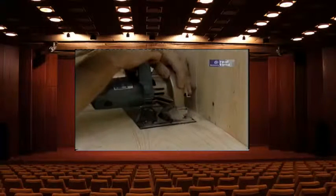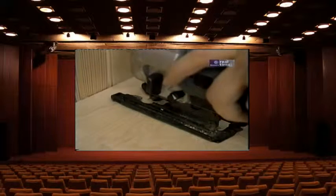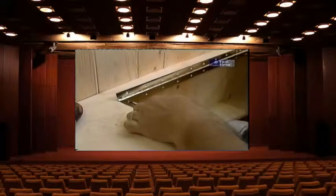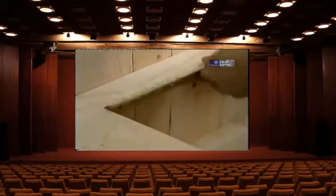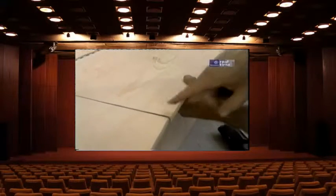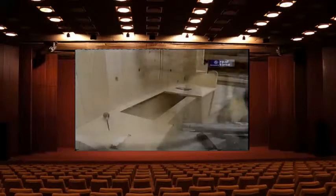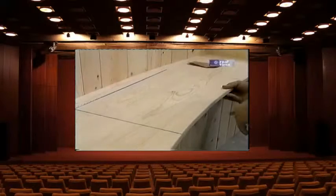This one is a little tough. This is a piece of inch-and-a-half brass-plated piano hinge that I cut from a longer piece. I'm temporarily fastening it to the seat with a couple screws so I can use it as a gauge — I'm going to have to plane the back of the seat until I get this front edge to align. Perfect. Now I'll secure the hinge for good.